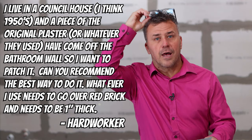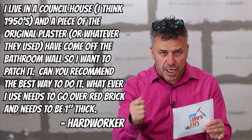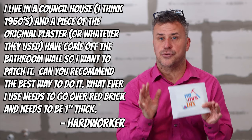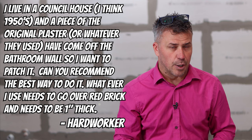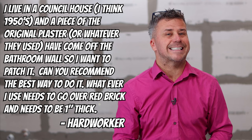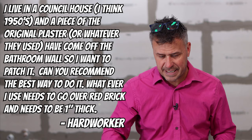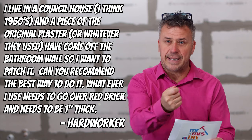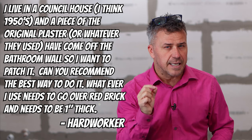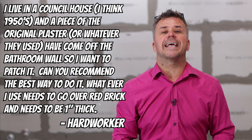So Hard Worker, what you're going to need to do is clear away any loose debris, chisel it all the way right down to that brickwork, dust it off and then rinse it with some cold water, and let it dry. Then you may need to seal that red brick with a bonding agent or sealant — apply that on and let it dry. Mix up a small amount of sand and cement like a render finish: four parts sand, one part cement. Give it a good mixing up and apply it in with a scraper or a small pointing trowel, but don't bring it to the surface. Leave it about two or three millimeters from the top, get it as flat as you can, and start to let it dry.